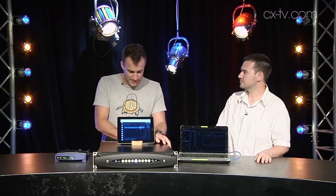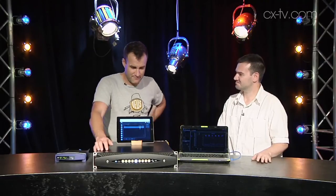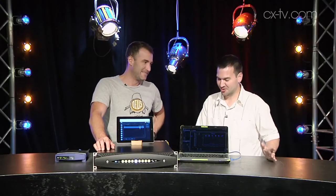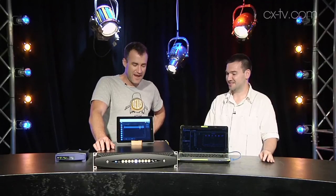Let's pull out some real-world examples. If you had dual 18-inch subs — eight ohms per driver, so four ohms per cabinet — you could hang two of those off each channel. Eight channels means 16 dual 18-inch subs, pushing over 2,000 watts into each cabinet. That's probably enough. You could run a whole line array off this, four sets of wedges and some stereo bi-amp side fills. There's very little you couldn't actually run off one of these, and it's only 2RU high.